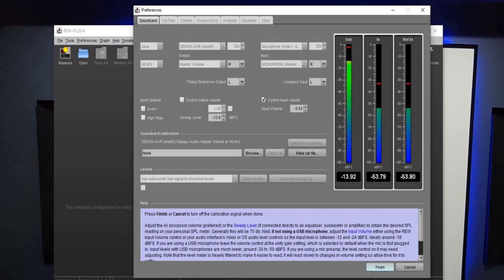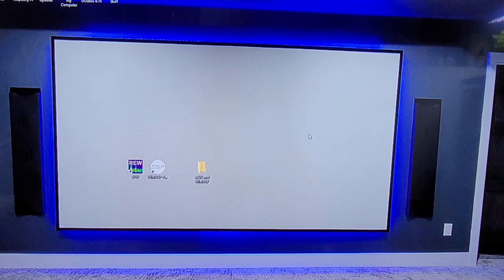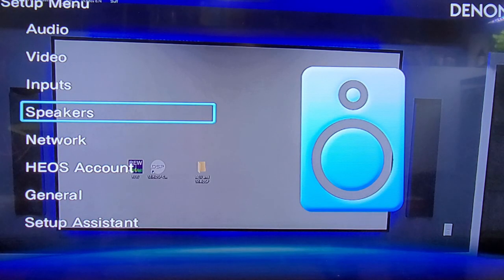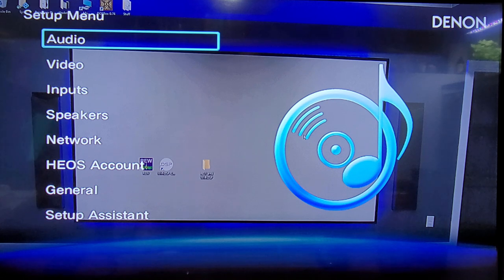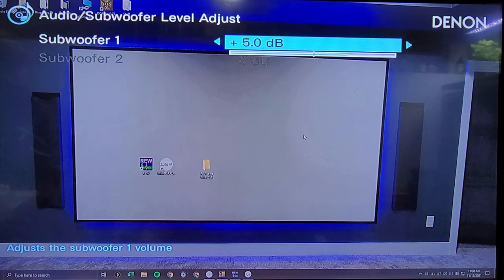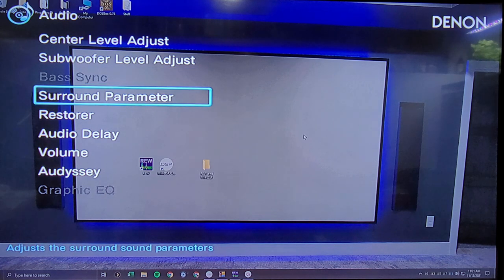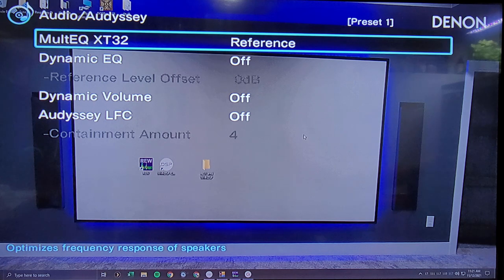When I click Next in the lower right, that starts this process, and I now have audible sound coming from my subwoofers. We are almost perfect — right in the middle of negative 30 to negative 50. We'll just stay right there. Now there are a few other changes to make inside of the Denon AVR before we can take any measurements. Using the remote, we're going to pop up the on-screen display. This may look different depending on your receiver, but you will have some form of these settings.